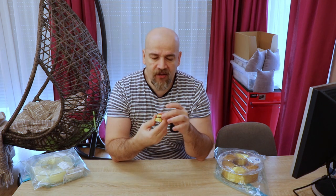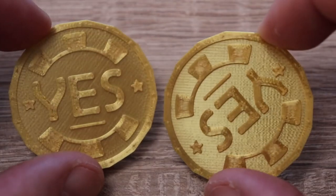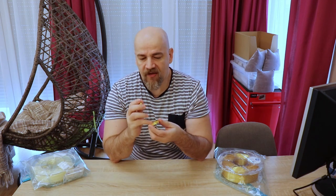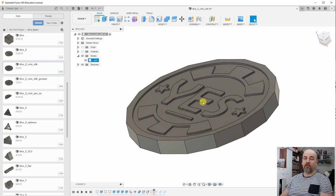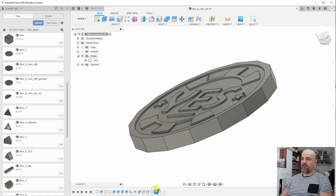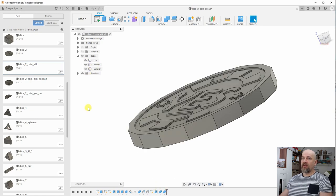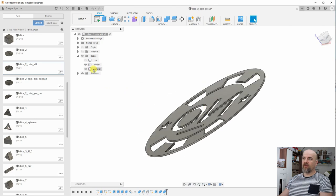With ironing I'm quite happy with the quality of the top layer, but I can see those closing holes. Theoretically the ironing should improve this. From the bottom, if I use the PVA filament it will fill the gaps between the 'no' letters and the background, so that bridging will not actually be bridging — it will be placed on the PVA support. Then we can insert it in water and the PVA will dissolve, and theoretically I should get a better surface. This is the coin in Fusion 360: the letters stand out 0.4 millimeters, so two layers are used for the letters. I created a cylinder and subtracted the coin from it to get two objects — this one will be from PVA as support for the background of the 'no' text.